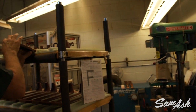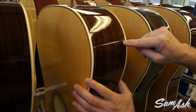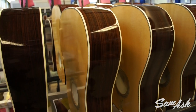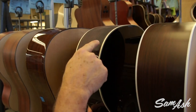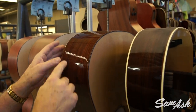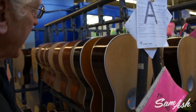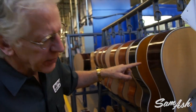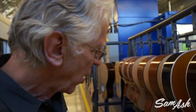If you can catch this in the reflection, this has gone through several coats — you can still see the presence of the pores. The guitars will come here and get sanded; after successive coats of lacquer this one is almost completely filled and ready for polishing. We have a lot of different finishing packages: natural finish without any toner at all, and here you can see the M38 toner, which is kind of a simulation of how lacquer turns golden over time. We have several shades in between.